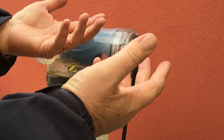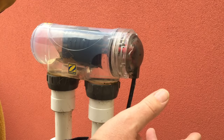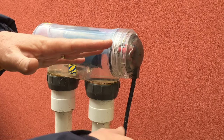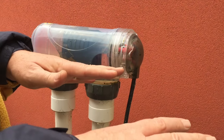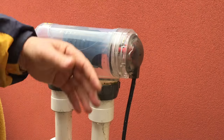You can put a very large dose of sodium bicarbonate in, which raises the total alkalinity and will cause the calcium to drop out and settle. Leave it for a few days to settle — you can also add some flocculant, which is sometimes helpful. Some of the calcium that settles will form a white layer on the bottom which you can vacuum out. Then vacuum the pool to waste — not through the filter — and you'll remove a huge amount of that calcium from your swimming pool.